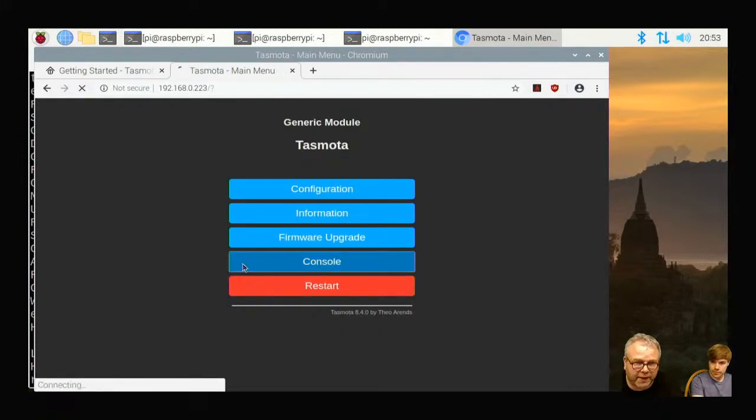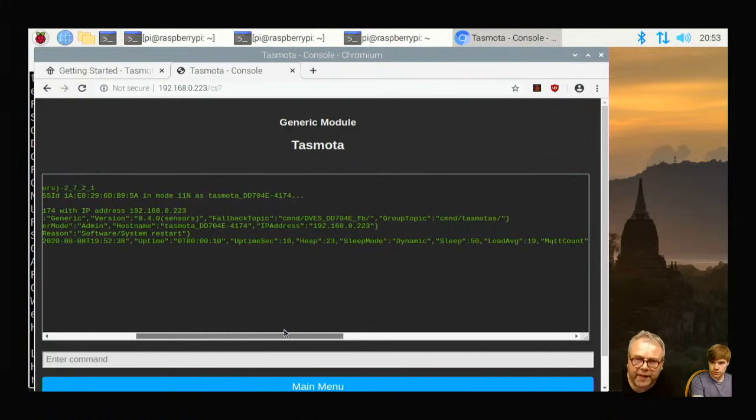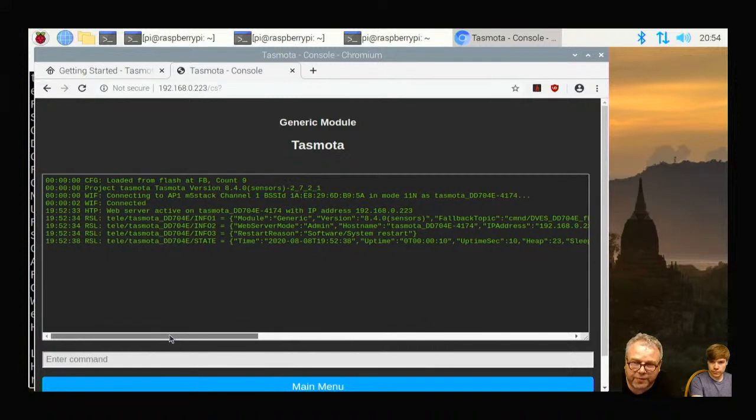And there's a console, which is the console page of the device. This has been loaded from Flash. I think this is the 9th time we booted up. It will show the IP address, that it is connected to a certain network, and some information like what device it is connected to, what my IP address is, what the uptime is, and all that kind of stuff. This is already being shared over MQTT. So what we're going to do is show a subscribe command on the Raspberry Pi. We need to configure this to use the MQTT server first.